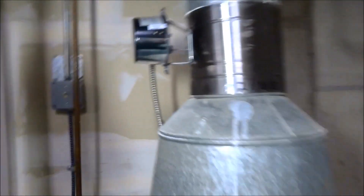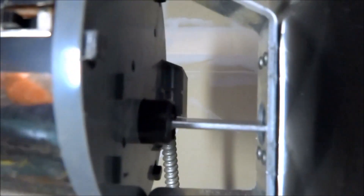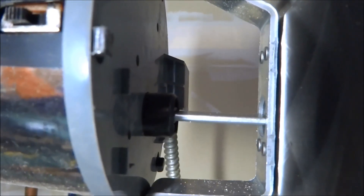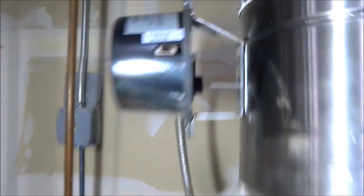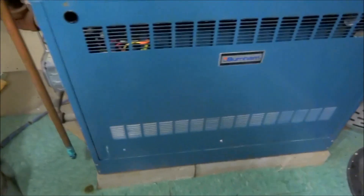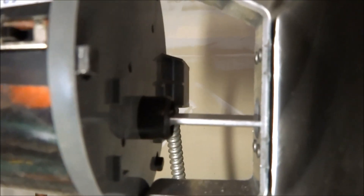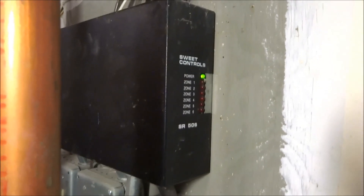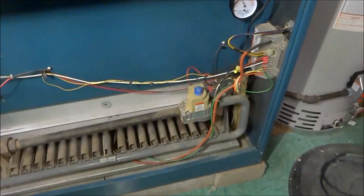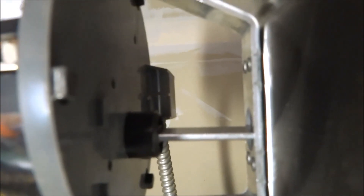What's happening is when this burner gets satisfied — see, it just hit satisfied. The burner shut off. That damper shut off. It's off on limit now. It's off on limit — it's calling for heat again and it will turn back on. It's almost satisfied there.